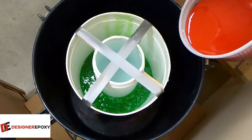With this hanging 8 inches off the headstock, this was a little risky to do, but it felt secure, so I thought I would give it a go. Probably would have been best to put the steady rest in place, but I knew that I wanted to fill some stuff here, so I thought I might have to do that on the very top. So that's why I did it. There's just some tiny little cracks in the burl, and there was a little bit of bark inclusion left behind, so I wanted to make sure that got hit with the thin CA glue from Starbond.